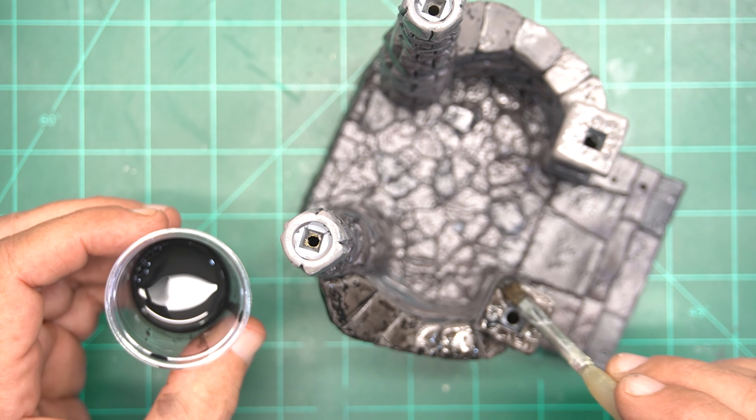I started on the electronics. Right now I'm working on the Ralph board, which you can find at shop.hobbylinkinternational.com. The bottom three channels I'm pointing at are going to give us our effects. I already pre-tinned this. I have a little blob of solder on the B channel — I'll heat that up with my soldering iron, push the wire through, and when I take the iron off it'll be stuck in place. Then I flip the board over, give it a little snip to clean it up, and everything's good to go.